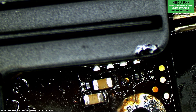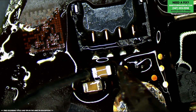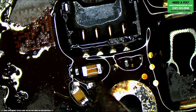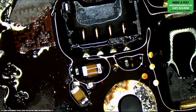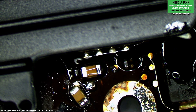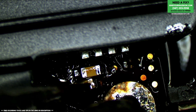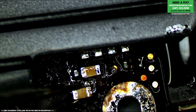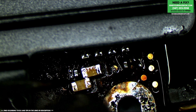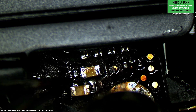Now I'm going to do something I shouldn't do again, which is be a perfectionist. It's not good enough that it's soldered on the board — I want it to be prettily soldered on the board. Can't leave well enough alone. What's really lame is those two pads that are next to each other: I thought since these are both PPBus caps that would be PPBus G3 Hot at the point that keeps wanting to touch, but it's not. It's actually ground on one end and PPBus on the other. That's really unfortunate.